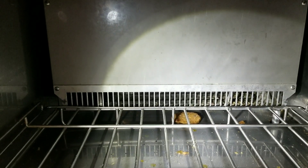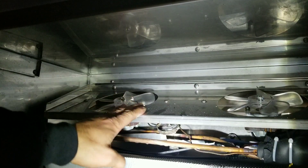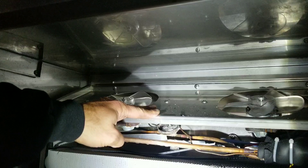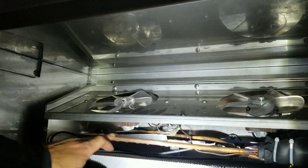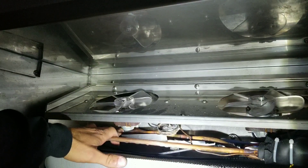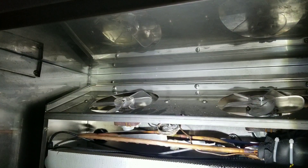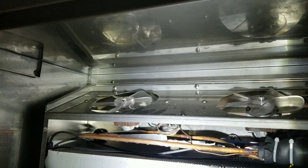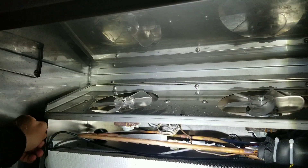Here's a bird's-eye view of our evaporator with the cover off. The fans spin freely — I'm assuming they're just not getting voltage from the controller; I haven't confirmed that yet. There's a little bit of frost on our suction line, liquid line, TXV, and evaporator inlet. Still a lot of frost build-up inside the evaporator coil. Quick tip: on stainless steel threads, go counter-clockwise until you hear it click, then turn it in — that means your threads are lined up.